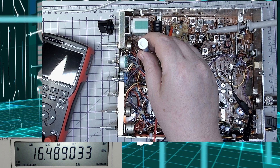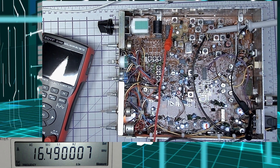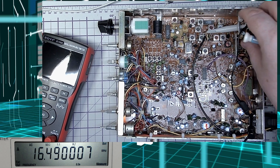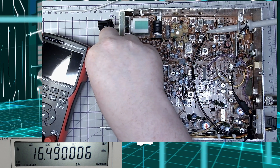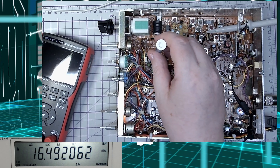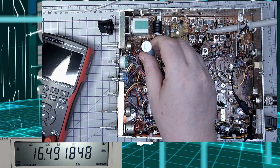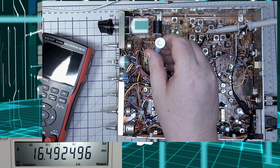First we need to adjust L21 for 16.490 MHz — AM, channel 19, mid-band. These coils are twitchy as hell so we've got to be nice and gentle with them whilst adjusting. This is one of the things that makes a DDS a lot more stable — there's none of this drifting about. Next, for USB we adjust L22 for 16.4925 MHz. Just a tiny little turn of these cores sends it all over the place, so we get it close — 16.4925 for that.